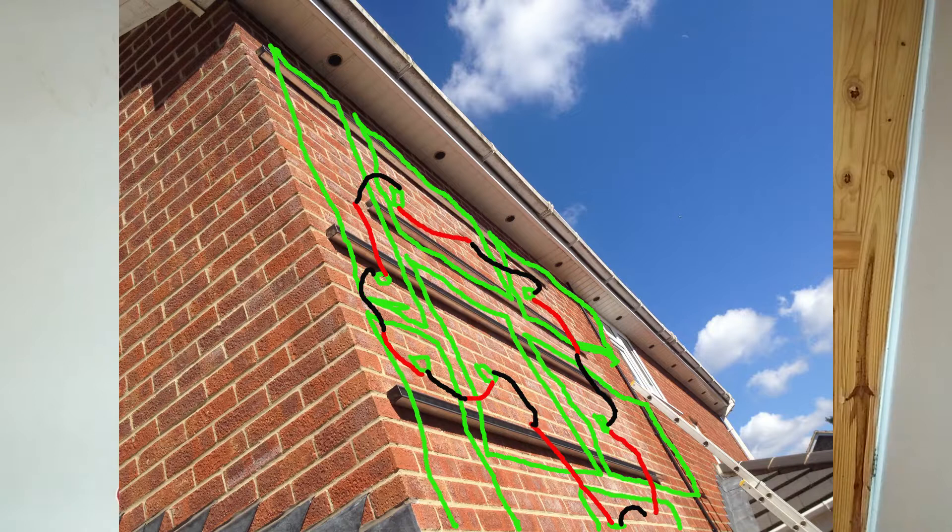When I originally decided to put panels on the wall of the house, I worked out that I could fit seven panels on that south-facing wall, and at about 300 watts each that makes 2,100 watts. So I also used a two kilowatt inverter with the hopes that the seven panels would max it out at the right time of year.